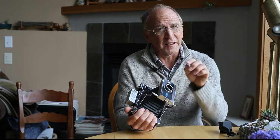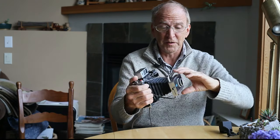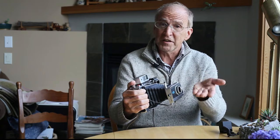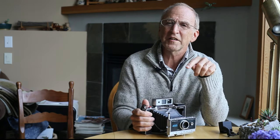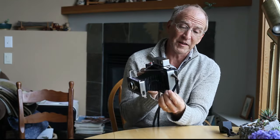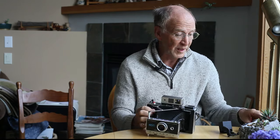There's a little shutter timing switch inside the lens body and it's really not that hard to get to. All you have to do is take the lens body apart, take the shutter circuit out, desolder the shutter timing switch from the ribbon cable, solder two wires to those terminals, and then lead them back into the battery compartment. After they're back in the battery compartment, you can hook them up to an Arduino.